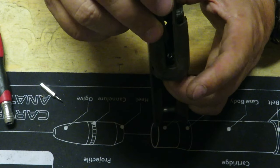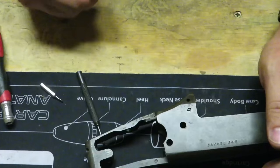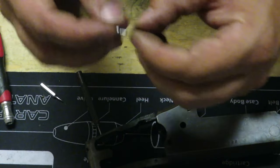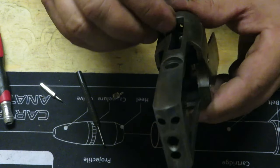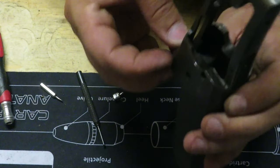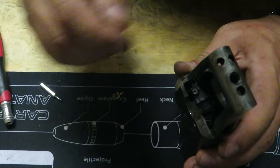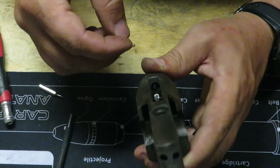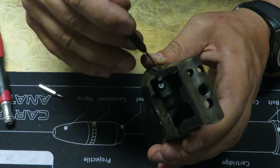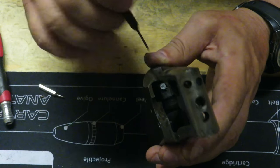This does not have a spring, so do a push-pull action to make sure it doesn't come out. In the same fashion, put the 22 in there — the 22 has the spring with it. Put the spring in the hole first, drop that down in there, kind of use a punch to line that up. Allow the firing pin to go down in there — spring's in, now drop the firing pin down. Make sure the flat end is facing the retention screw.